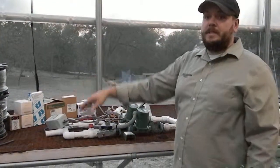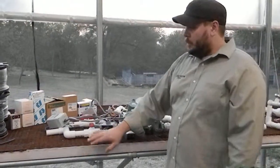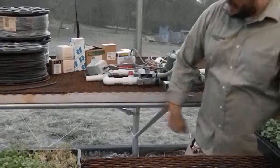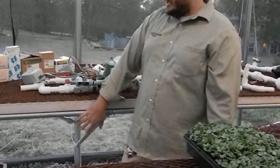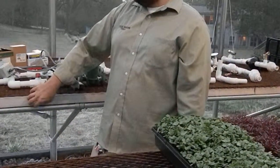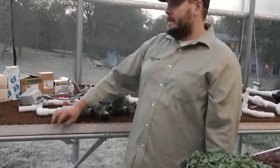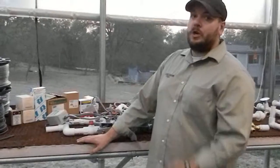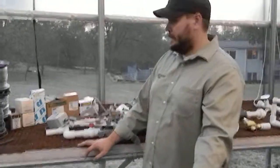After this water goes through this, it's going to go into your benches. What we have right here is integrated shelves built into our greenhouse. That gives us great space underneath. On top of that, we've got 2-inch thick insulated foam. This makes sure that as we're heating the radiant lines, that temperature is getting trapped and forcing the temperature up as opposed to down where there aren't any plants.